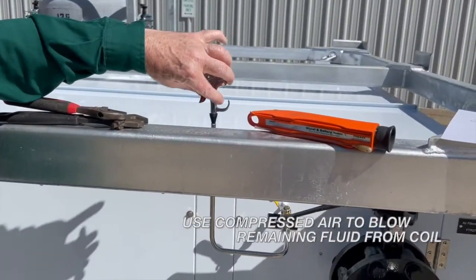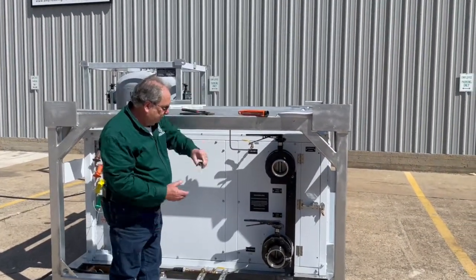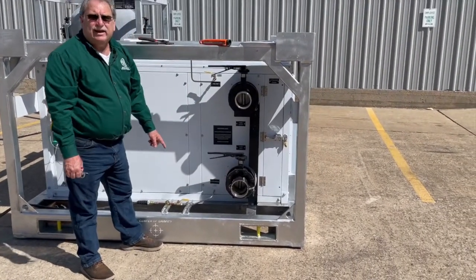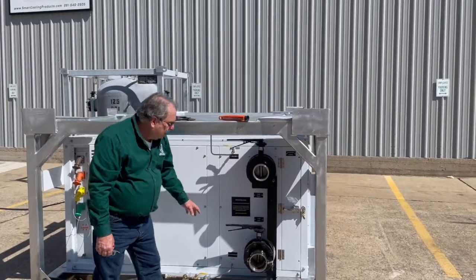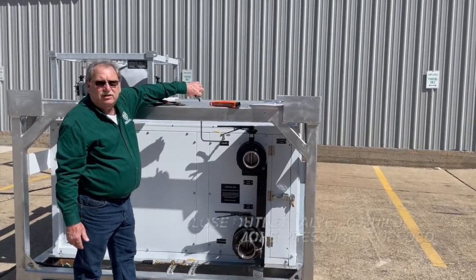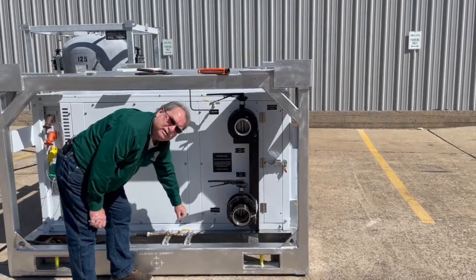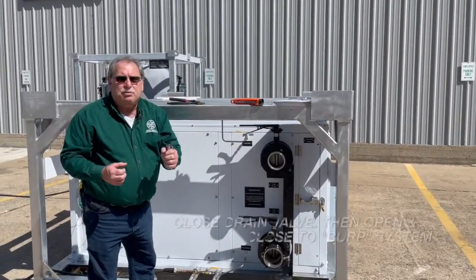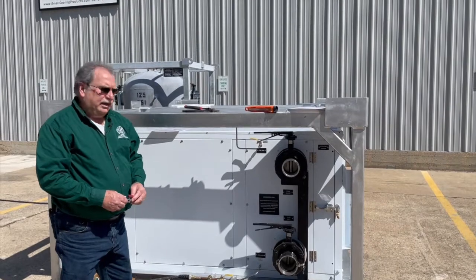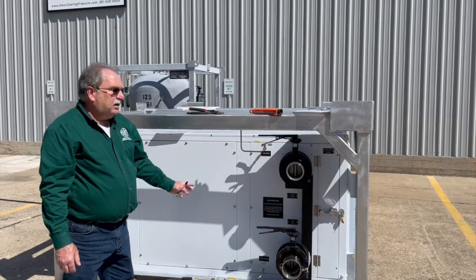You can see how I'm putting it into that tube — I'm going to pressure up the coil, getting a little bit of pressure, and watching to see what comes out. If I'm not getting much, I may have to close some ports and keep one open to build up more pressure in the coil and then burp it — meaning opening and closing the valve to allow the pressure to keep pushing the water out. Once we're satisfied there's no more water inside the machine, you can go ahead and put it in safe storage.